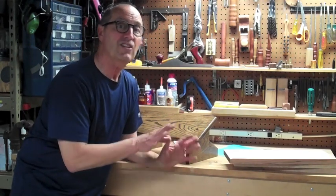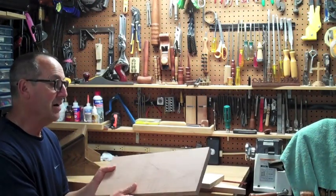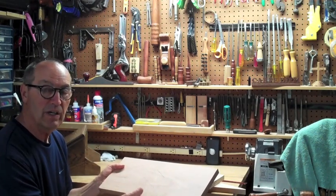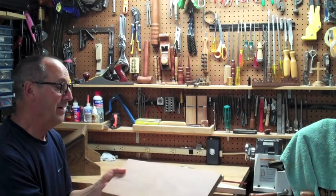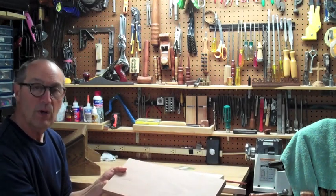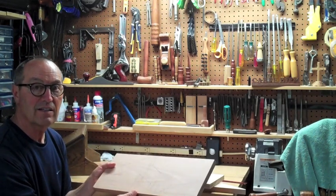So I thought maybe I could duplicate that with wood for my new easy chair. Now there are two different ways I can do this job. I could cut each piece out and hope they turn out as twins to one another, or a better idea — the one I'm going to use — is to split a piece of wood, flip it over, tape it together, and cut through both at the same time so I know they will be identical. So I'll go ahead and get that done.